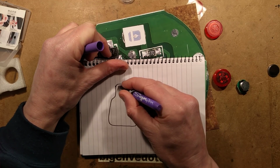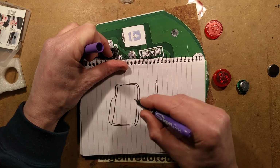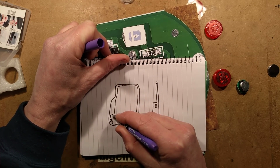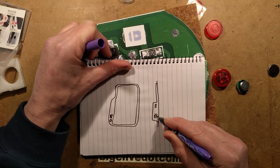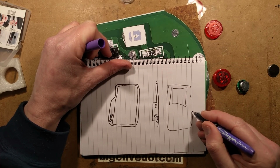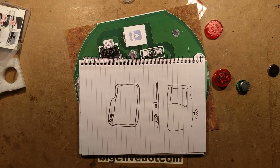The other part of the door, the seal came around the outside, and then it had a sort of wider lip down here. And there was a big rubber bump here, which is for slamming the door against. And in the vicinity of that, there was enough space to actually put the magnet, and then the matching LED could go on this side. So when the door was actually open, the LED would effectively be on the side here, projecting out into the path of oncoming vehicles.